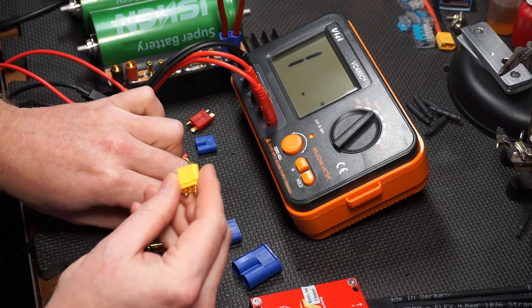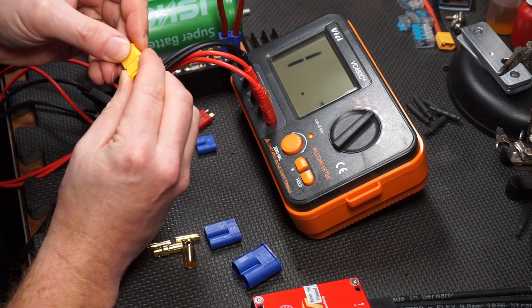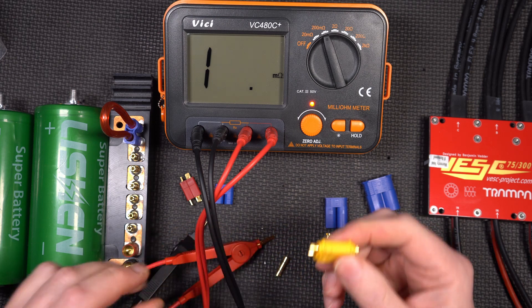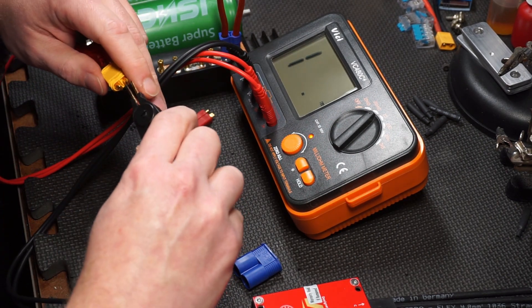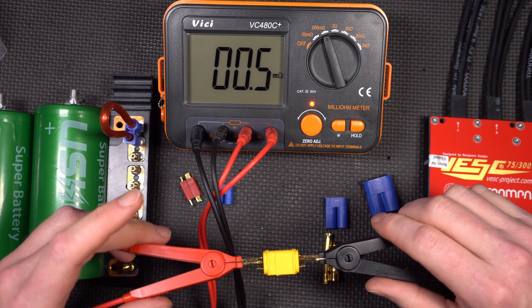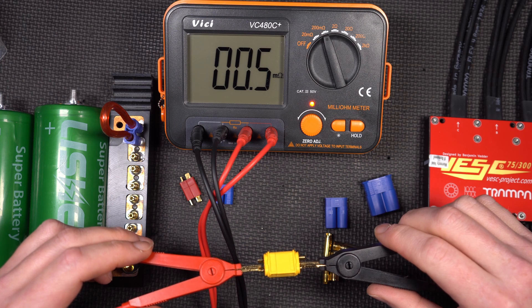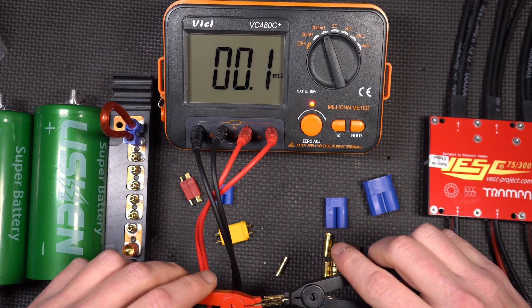Now, what is probably one of the most common connectors — this is an XT60. Out of all of these, this is the only one that's like an actual name brand. This is an AMASS brand connector. I'm going to put links to all this stuff down in the description below. What I like about these is they have that little gray plastic thing that clicks on the back, so you don't have to use heat shrink tubing. It's a little bit better than the EC3 — about half a milli-ohm on that one. Let's check the other one — also half a milli-ohm. The meter is still solid.